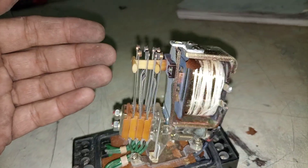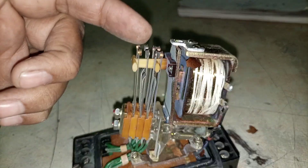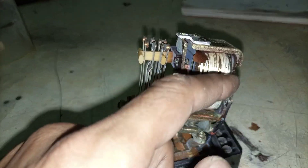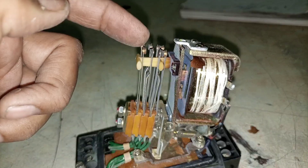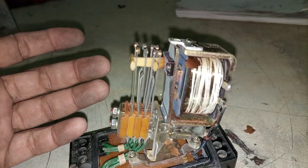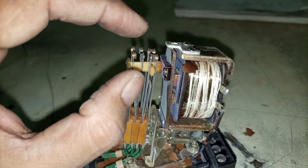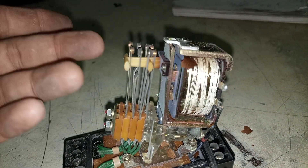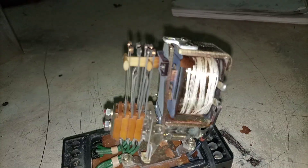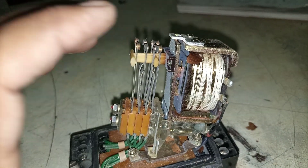This change of state is what we use in our circuit. We supply a small amount of power to the coil — something in milliamps — and through that we can control a much larger circuit, perhaps 5 to 10 amperes or even hundreds of amperes with bigger contacts. Relays that control very large currents and are used for motors are bigger in size and are known as contactors.